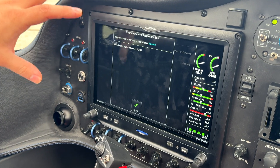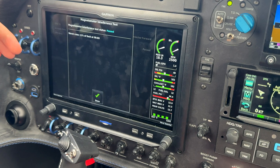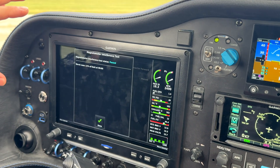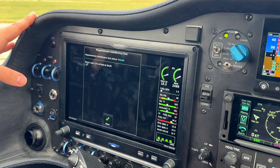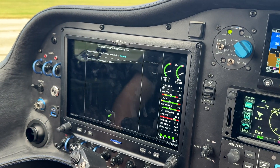Some older TSI kits had the magnetometer close to the luggage compartment underneath the golf bag extension, and if that is you, you really should consider moving that, because anything metal inside that luggage extension would cause the magnetometer to start going haywire and go well above the 100% limit.